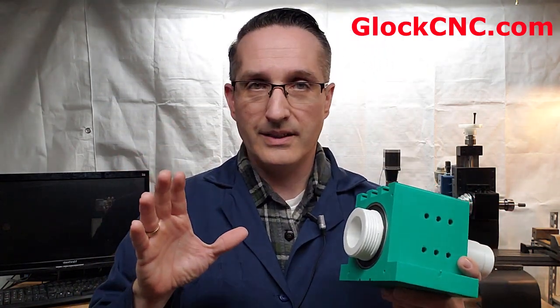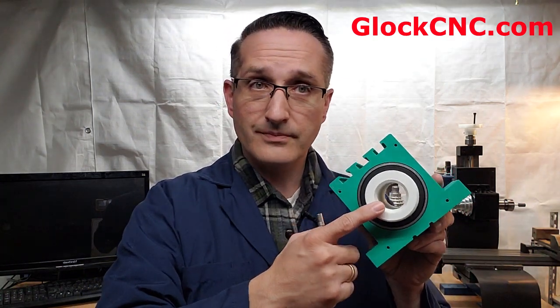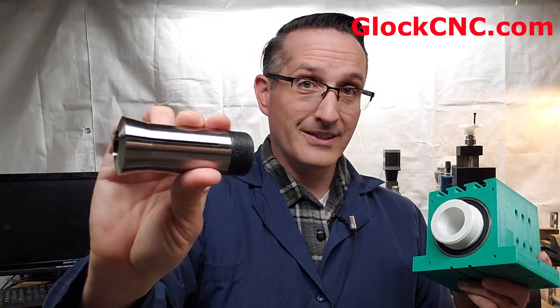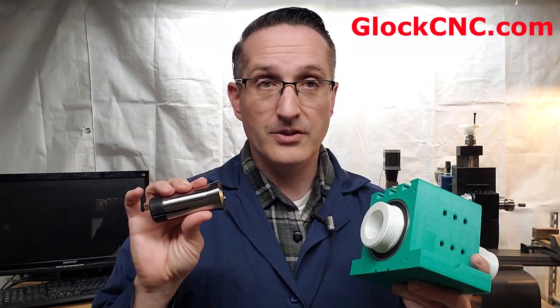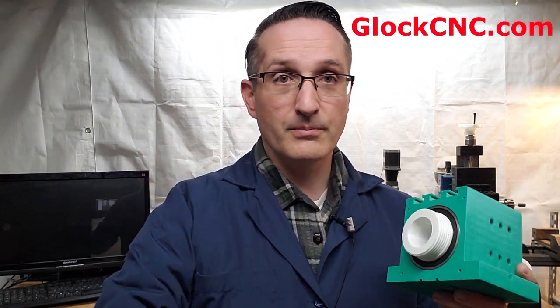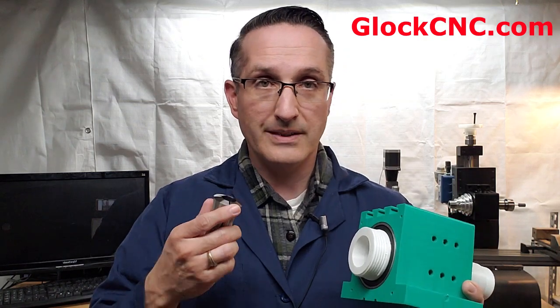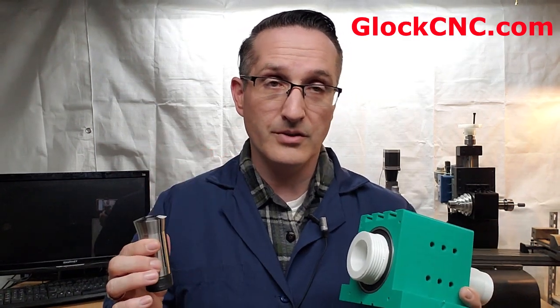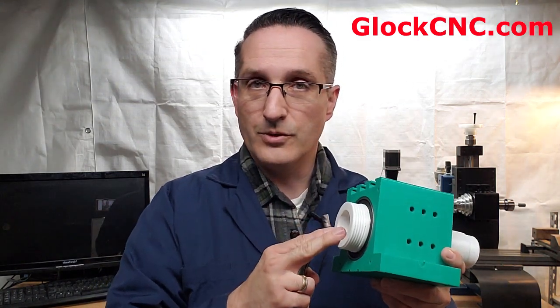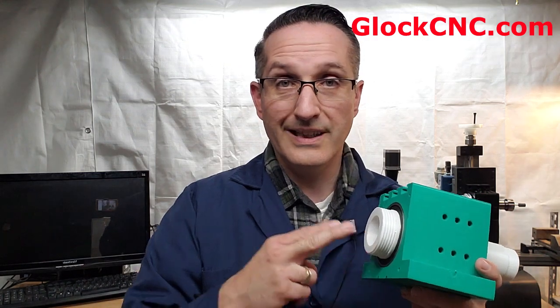This really opens up your abilities as far as having a 5 or 6 inch chuck. And not only that, when you have a nice size chuck like that, you can take advantage of the 5C's large through hole. This through hole is a little over 1.3 inches, so you can fit a pretty good chunk of stock through there. The 5C collets come in a very wide array of precisions — Hardinge has a 2 ten-thousandths runout collet, which is pretty significant. You can get these in round, square, hex, or rectangular. There are all kinds of options for shapes, and there are even serrated versions for extra grip. There are adapters, expanding arbors, and different options you can use in the 5C, which really opens up a whole new world for your lathe.